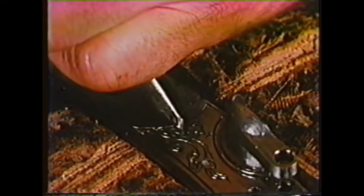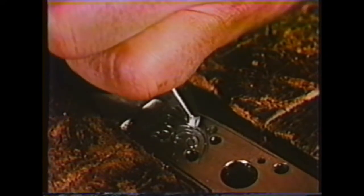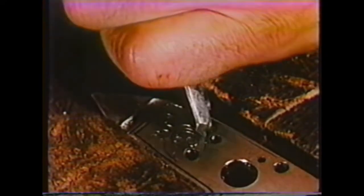The basic building blocks of an engraved design are C scrolls, S scrolls, flowers, leaves, and shell designs. A combination of these different details can create endless variations — if you took the same design, you might be able to engrave it 500 different ways. You have these various options: you can make some parts move toward you and some move away. If all the pattern is cut the same, it's flat. If you vary the depth of the cuts, it has much more feel — you get a three-dimensional effect.